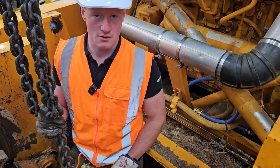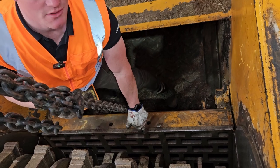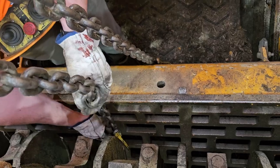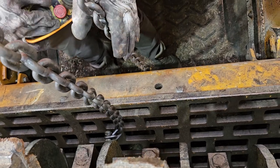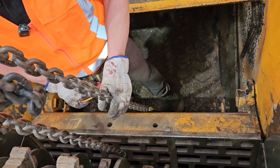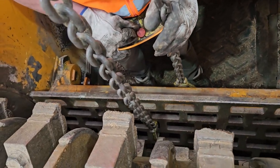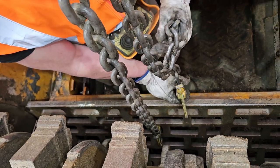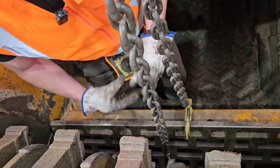For the lower section of the grate, you want to lift it up a little bit and then release it. Once you have access to the top section, lift it up again. Securing your lifting hook as low as possible, gently lift the cradle up and out, then gently lift the lower grate up. Now you have access to put a second hook in the top part of the grate, lowering it down to release the first hook.